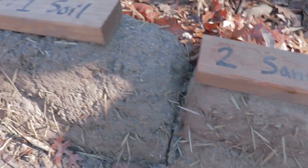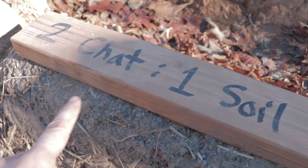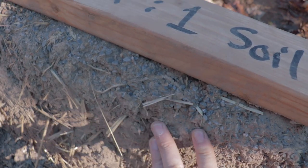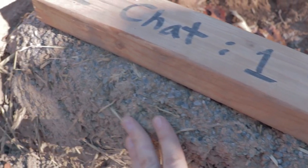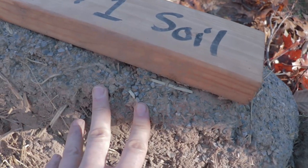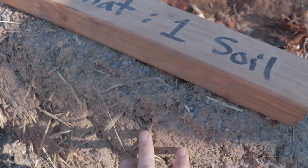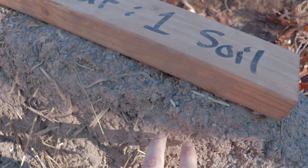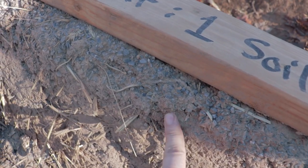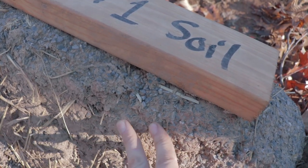We can get better than that. Our next one was two parts chat to one part soil — we just switched out the aggregate type at the same ratio. It has a lot of the same drawbacks; it's a little sandy still, but not quite as sandy as using the masonry sand. We had to make this one a little more wet to make it pliable, otherwise it was a bit dry and didn't stack very well. So it's going to dry out slower with similar issues, but the chat version is slightly stronger and a little less sandy.